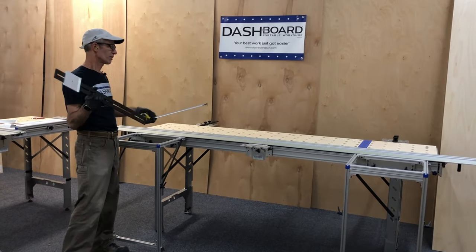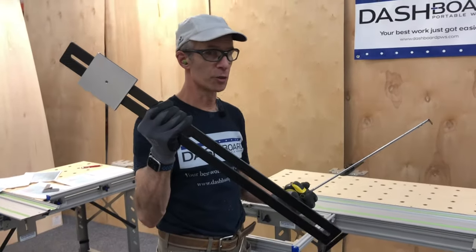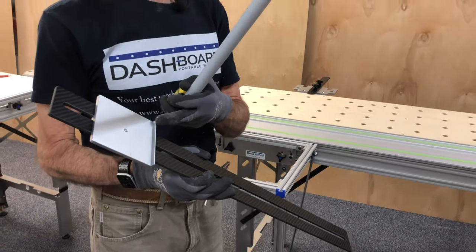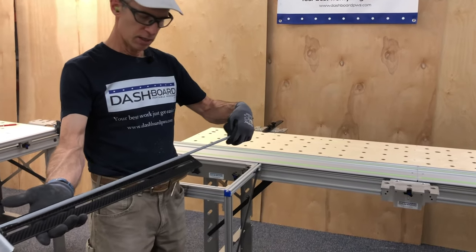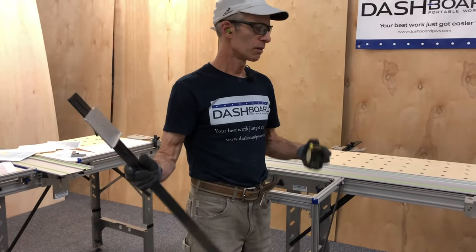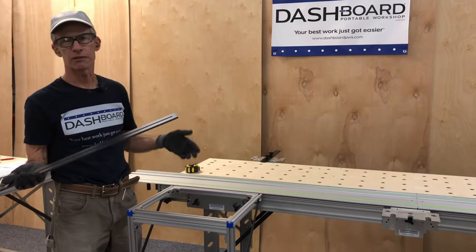This is where we set the dimension of the cut from the rail to the parallel guides — this is how we operate the rip gauge. We have two sizes: this is the rip gauge XL because it's super long, and we have a shorter one. The plate has a tab that represents the thickness of your blade. To set it, choose your dimension on the tape measure and set it against here, because this is what's going to be left from the cut. Extend the arm by loosening the knob out to whatever dimension you want — here we're doing 23 and three-quarter inches or about 602 millimeters. This gives you a physical template for setting two stops simultaneously, which is better than other parallel guides that rely on reading two separate scales.